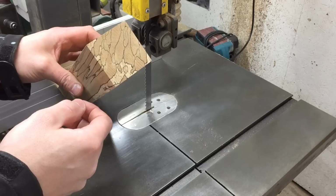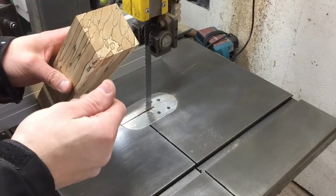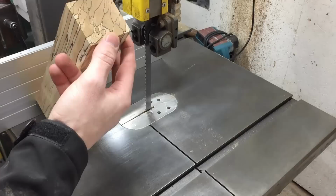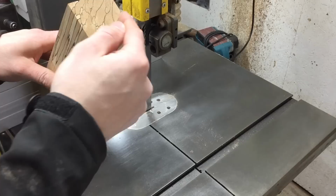Now, my box that I want to inlay it into is about 65 millimeters diameter. So I want the book match to be just under 60, somewhere between 55, 60 millimeters diameter, the disc when it's finished. So this spindle blank is 60. Each cut across the end grain that I'm going to make will make two sets of discs, but you have to start with the square of the finished diameter that you want. But that'll make more sense in a minute when I show you.